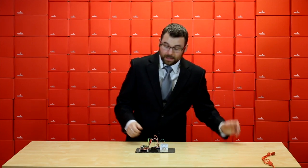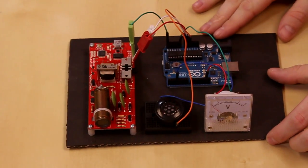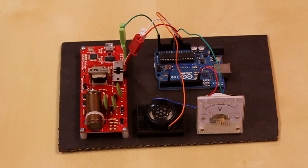Next up, we've got a new revision of the Geiger counter. As you can see, it largely looks the same, but we've made a couple of small additional changes. We listened to all the comments on the previous generation and redesigned it. We've completely redesigned the power supply, so it's a lot more regulated now. We're also changing the way we read the tube — instead of reading the falling edge, we're actually reading the rising edge, so there are no more issues if you want to detach the tube, and there are no capacitance issues. It's a lot more accurate and a lot more robust design.